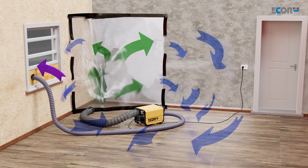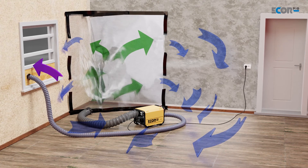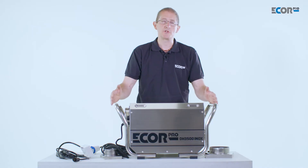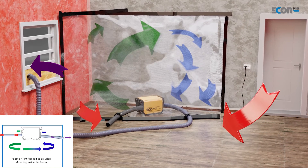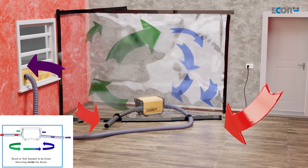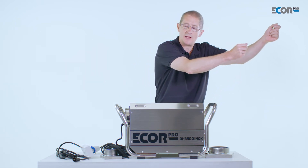In its operation, ducting can be taken from the dry air outlet and ducted into the chamber or area we wish to dry. Ideally the machine itself could stand in that chamber so it can recirculate the air, allowing the air in the chamber to become drier and drier. Ducting would then be taken into that chamber for the machine to dry its wheel and take the humid air out.